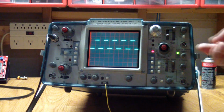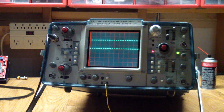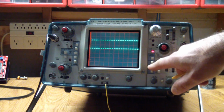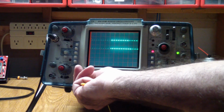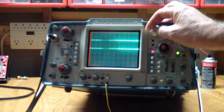So the hardest part, of course, is getting that waveform, but I'm going to cheat and use the scope's compensation output. And this is shown using the A time base. And let's say this is our waveform, and we want to observe or go into detail and see what's going on in there. So the way to do that is on this scope, we go to the A intensified, and what that means is it's showing us the portion of the waveform that we want to see in detail.